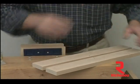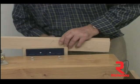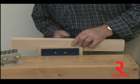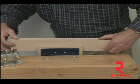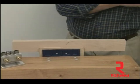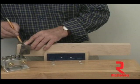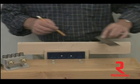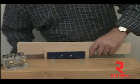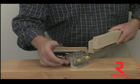Now, first of all, we place these pieces of wood back to back. Place them in the vise. Tighten. Get the set square and mark the faces to be drilled, which will coincide with the end of the reference block.